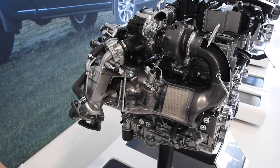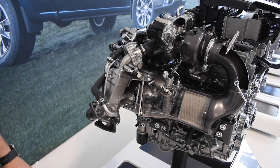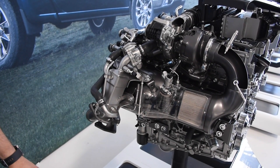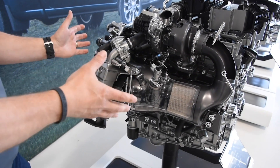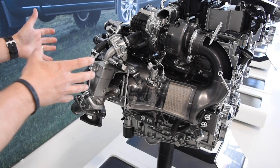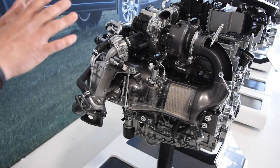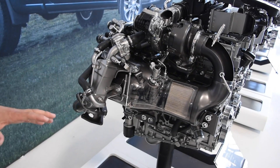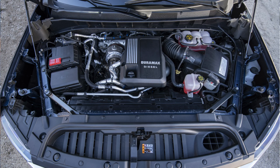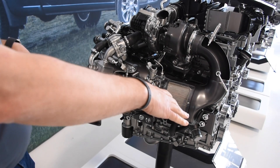In other vehicles that assembly is typically underneath the vehicle, not next to the engine. The reason is engine architecture — there's no room to package it up front. By being able to bring it up here closer, we get more heat into it, making it more efficient. Looking under the hood, you'll see that the components around this very hot item include a shield with aluminum tape in the right spots, and we give adequate clearance for it in the under-hood environment.